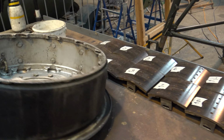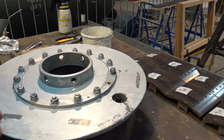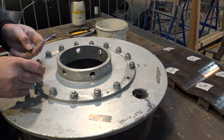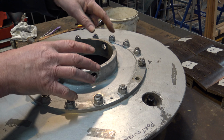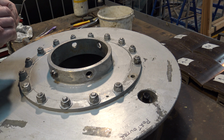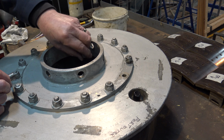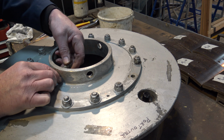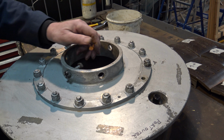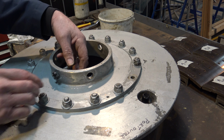These nuts and bolts. These ferrule nuts go in that way. Once this is in place on the axle, you stick your hand down the axle, and then the bolts go radially from the inside out, and then screw into your ferrule nut. So then that's your torque plate bolted to the axle.